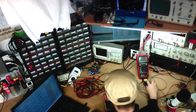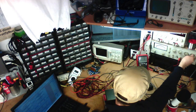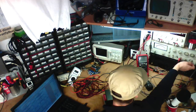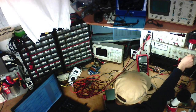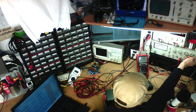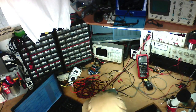Anyway, right channel, left channel. Set our reference, 1 kilohertz. -4 decibels, there we go. Let's just do the high end right off, since that's what seems to be interesting. So at 10 kilohertz, we're down 2 decibels. Yeah, at 13 kilohertz, we're down 3 decibels again. Wow.